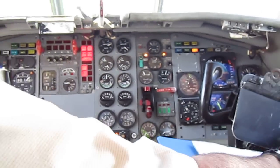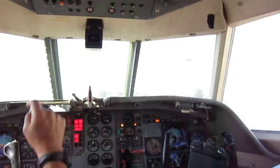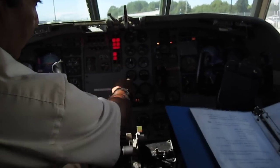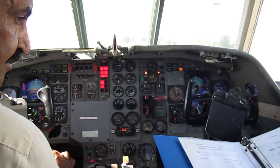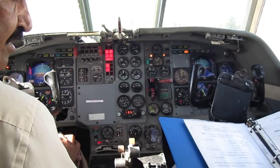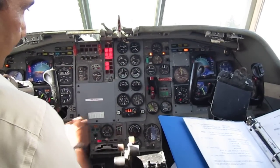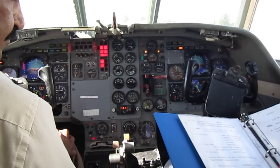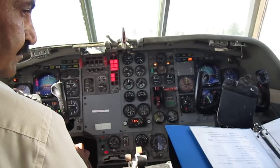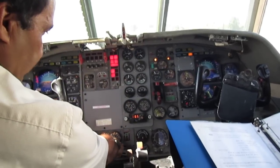Let's go to the checklist for the right engine. Green ignition indicator light — out. Gas generator RPM 45%. Turbo fan RPM — does not work on the right. EGT 500 plus. Oil pressure 25 PSI. Fuel flow 500 pounds per hour. Park brake light — out. Hydraulic pressure 3,000 PSI.